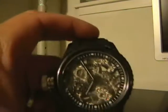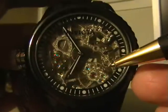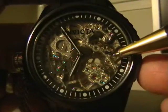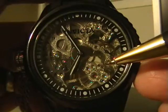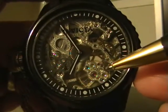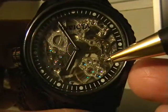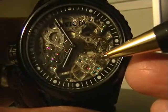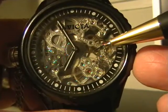What you're looking at, I'm not a horology expert, but let's just point out some of the details. The main feature is the balance wheel, the escapement, the little escapement lever, and that's what basically regulates and cuts up, so to speak, your seconds with the 21,600 vibration per hour heartbeat. So basically every second around the dial is subdivided into 6 divisions, and that's what that escapement wheel does. Driven directly off of that is your second hand complication. So that's actually a pretty cool thing.